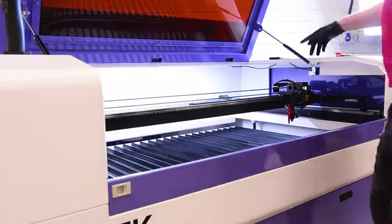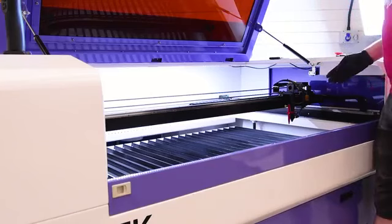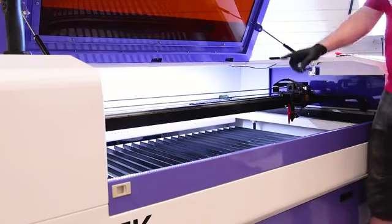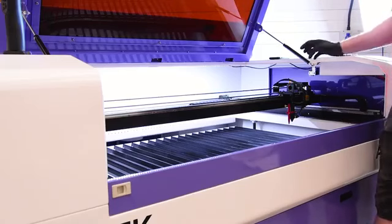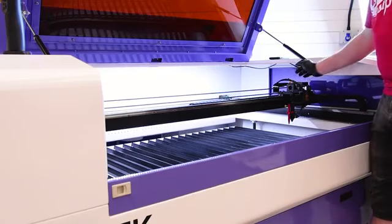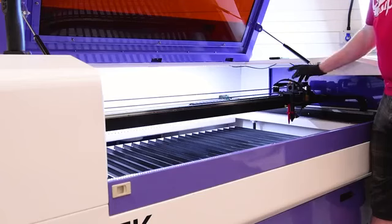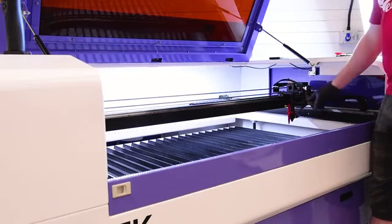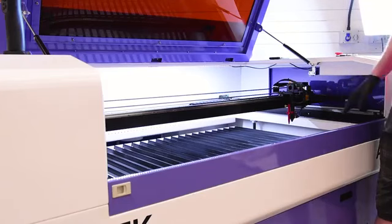The laser path for the infrared laser is mostly aligned now. The red dot laser still needs some work. I should go back over this path and get it perfect, but for now we've got it coming into this mirror pretty well, and now we want to get it shooting down through the main lens correctly, and we'll be ready to do some cutting.